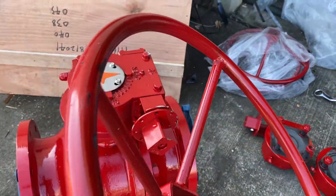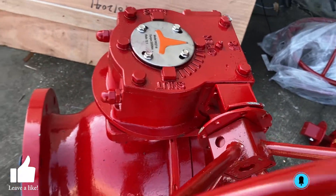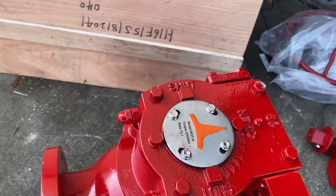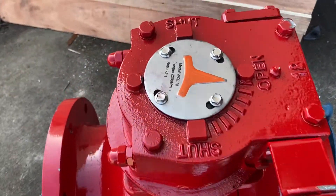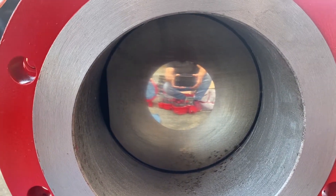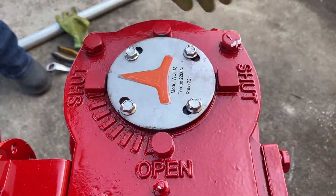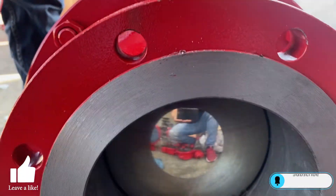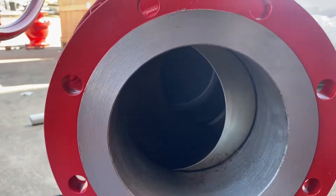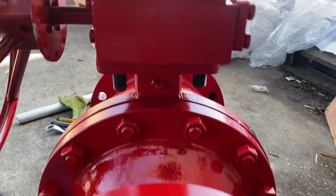So now we want to function test to make sure the gear is working properly. We'll put our hand wheel onto the bushing and we're going to begin to rotate it clockwise to close the valve. As we rotate it you can see the position indicator moving. Here is the ball as we are closing the valve. Now the valve is fully closed — the indicator should be in the shut position. Now we're going to open the valve by rotating it counter clockwise, and the indicator should come back to the open position.